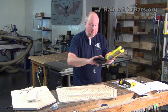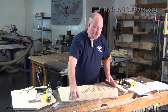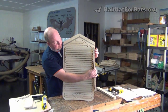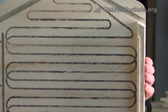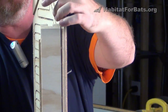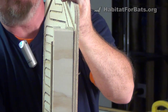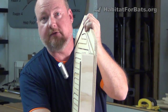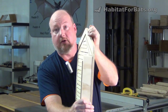Start by laying the sides out. The side goes on so that the cut bevel matches the slope of the roof. This is how the side goes on so that it is flush to the outside, and the slope matches. This is going to be important — the bevel needs to be even to the bottom of this slot. We don't want it too high and we don't want it too low; that would leave a gap. The tab and slot is fairly precise, but it does allow for a little bit of adjustment on purpose to allow you to align it perfectly.